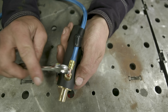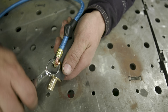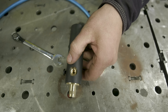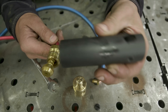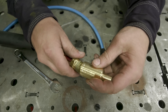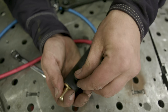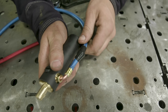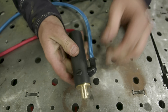All right, we've got to remove this fitting because our red power cable goes right in here and screws in. Use a 7/16 wrench to undo this — it's right-hand thread, so undo it normally. Then grab a flathead to undo the piece that holds the plastic connector. Don't forget to put the boot on first — this is very important. It's left-hand thread, so screw it in accordingly, then tighten it up. The boot goes back over, and the housing stays on with a Phillips head. Put this back in here; make sure there's snug water flow. Put the boot back over because power flows through here — we don't want anything arcing out. That's it — we're ready to plug it into the machine.